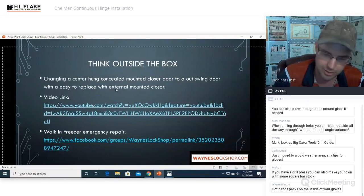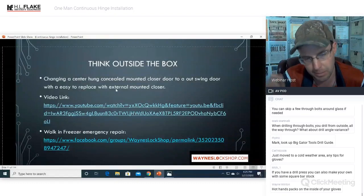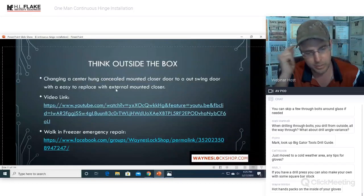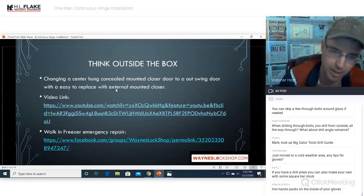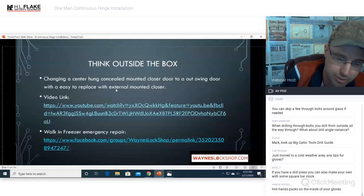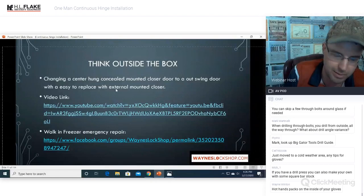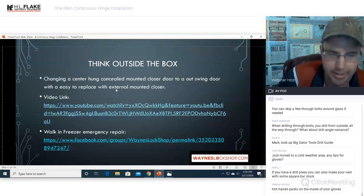This is the stuff that just separates the pros from the Joes. That is the stuff that burns your brand, yourself, your company, and your image into that customer's brain, and it will never, ever come out of there if you take those extra steps. One more thing I want to add to that: every time you do one of these doors that has glass, take some glass cleaner, wipe that door down inside and out, get rid of all the fingerprints and stuff that you put on there during the installation, and you are going to shine like a rock star.